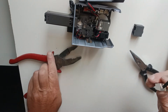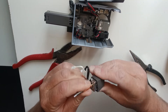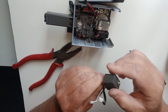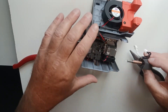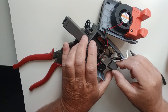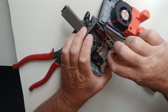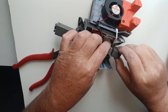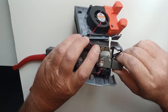Just don't touch it when hot. To put it back, just reverse the process — goes in very easily. Make sure you put your sock on so it goes right to the top with the nozzle showing through, then push it back up and into the heatsink. Make sure it's not loose and the nozzle won't come out — give it a little pull to check.